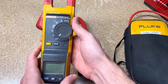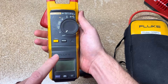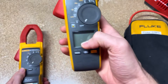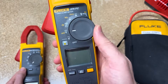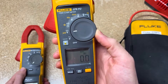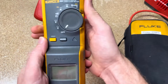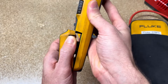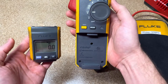The form factor is different as well. If you want to be in two places at once and view your readings wirelessly, separate from the clamp meter, you can do that with both of these. The 376 FC requires a smartphone — you connect to it via Bluetooth and see the reading at a distance on your phone. It's not a self-contained unit; you have to use a smartphone. The 381, however, is self-contained. You pull the display down and out to the side, remove it, and now you can take it remote via Bluetooth.